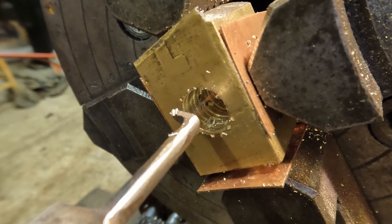Because this lathe is reversible I can leave the half nut engaged throughout the whole threading operation. After a scratch pass we begin cutting the thread properly. It's always a good idea to verify the pitch with a gauge at this point, but you'll just have to trust me that I did that.